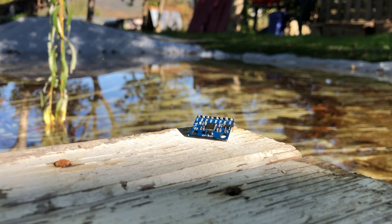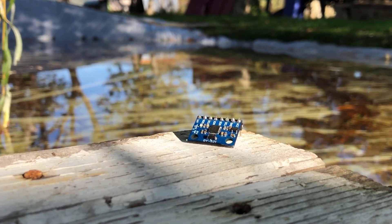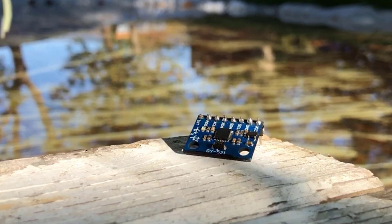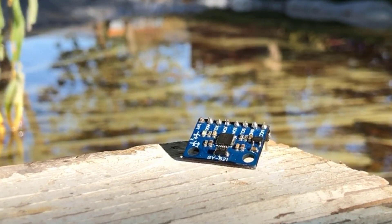To make this project work I used an MPU6050 sensor with 6 degrees of freedom. It combines 3 axes of gyroscope and 3 axes of accelerometer together with an onboard digital motion processor using motion fusion algorithms.